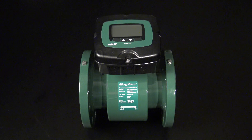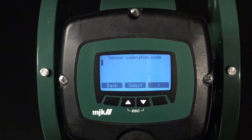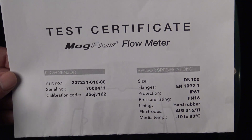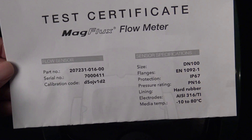We are now ready to power the unit up and program it. It will also be possible to have a remote installation, for which you need a wall mount kit. After we have finished the physical installation we are now ready to power up the unit and set it up. We will start by typing in the sensor calibration code which came with the test certificate that came along with the sensor. Please remember that there will be a difference between capital letters and small letters.